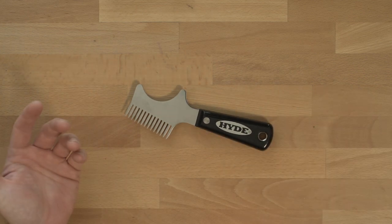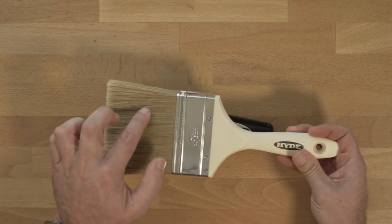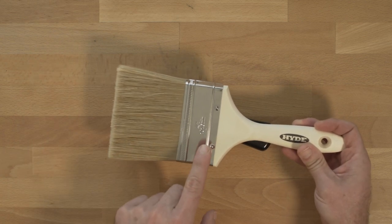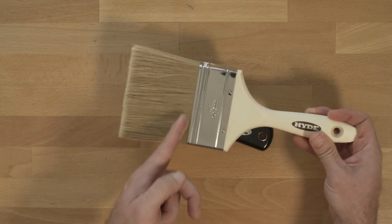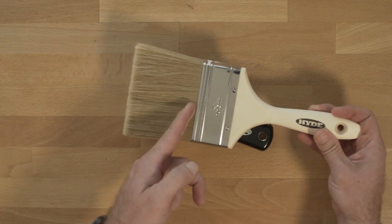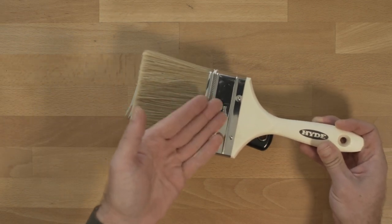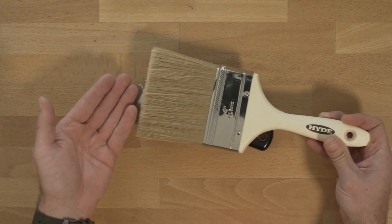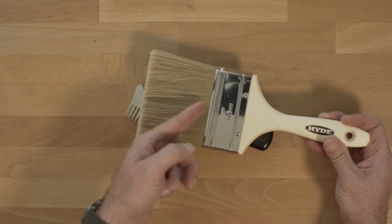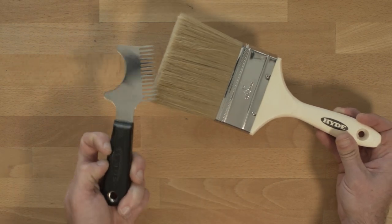If you're doing painting right, you'll never let your paint get closer than about an inch away from your ferrule. That's when you can run into problems — with the paint getting up in there and drying up and ruining your brush. We've all been there where we accidentally get paint right up against the ferrule, and it starts drying. That's where the brush cleaner comes into play.